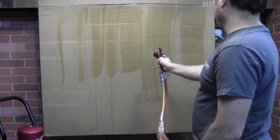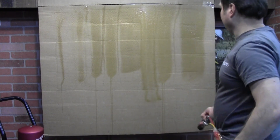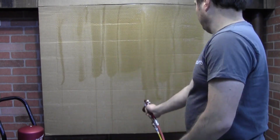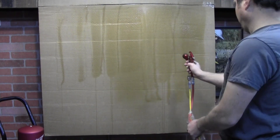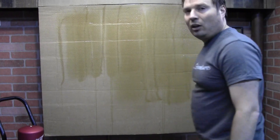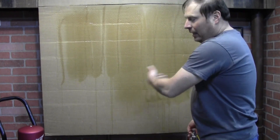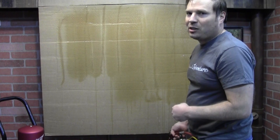Bringing the atomizing air back down, then adjusting the fluid pressure back up — we don't have enough fluid pressure now, so let's raise it. Getting a little bit of tails, so I'll bring the atomizing pressure up slightly. There we go. That looks pretty good — a nice soft spray. Granted this is water, but you do the same thing with any other material you're spraying. That's how it works. Now let's go to the other shop and actually paint something.